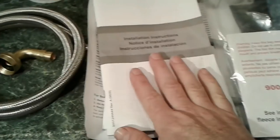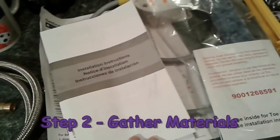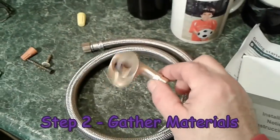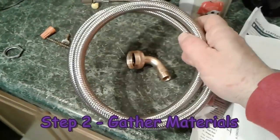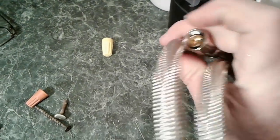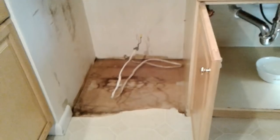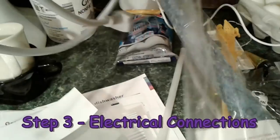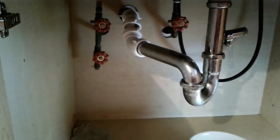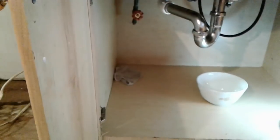I'm done reading — I read the entire instruction manual. The French was kind of tough but I am so ready to go now. I had to run out to the hardware store to buy one of these elbows for connecting the water line. I also got a new water line because the other one was 15 to 20 years old and the rubber inside the end of the hose can deteriorate over time. The first thing we're going to do is work with the electric. This dishwasher comes with its own electrical junction box, which they want you to mount in the adjacent cabinet.